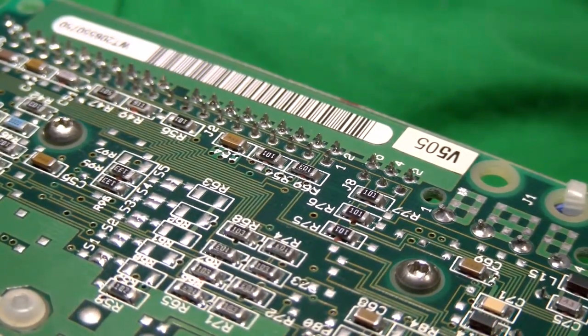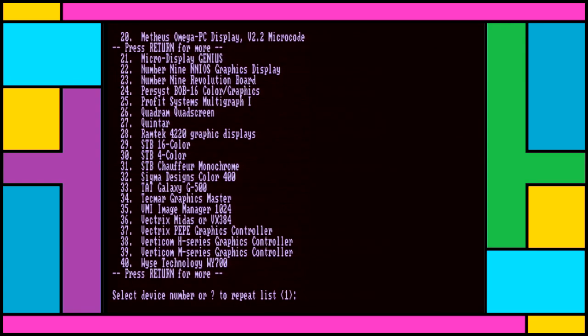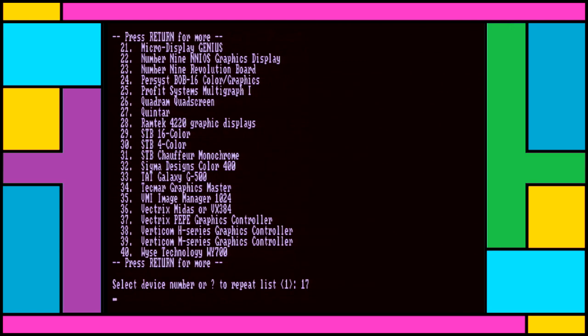In any case, we get to DOS 5 after what's really only a brief wait. I did consider using something older like DOS 3, but couldn't really find any advantages to doing this, only a bunch of disadvantages, so DOS 5 it was. And that's it. There's no TSRs running or anything. It's not like there's anything going on in this machine to need them. There's just a utility to sync the OS time with the RTC that doesn't stay resident, and that's about it. Also, the clock seems to be running a bit slow. Now what?